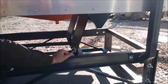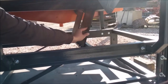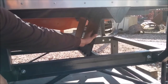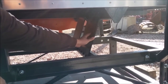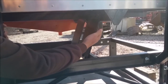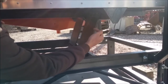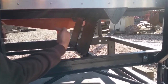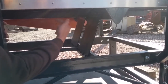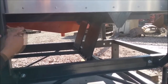Now I want to talk about the mechanics of the shaker table. The shaker table top is supported by four different sets of springs — steel sheet springs that hold the shaker table top to the base. They're angled at about 15 degrees, and when the shaker table moves, it forces the material to not only move across the table towards the high-grade end but also gives it a little throw upward, so the force allows the material to hop down the grooves.